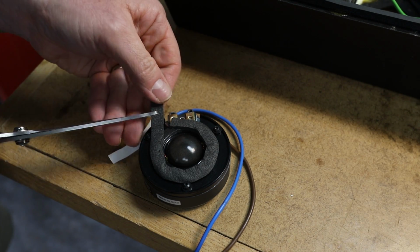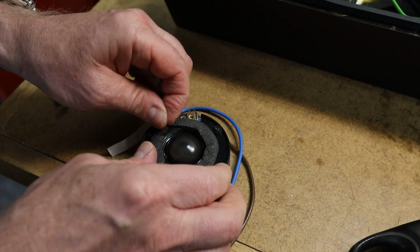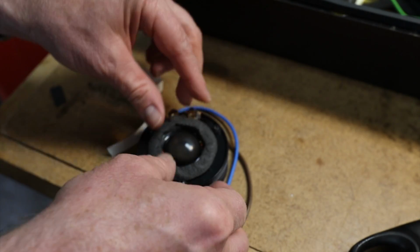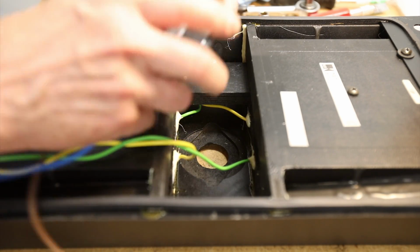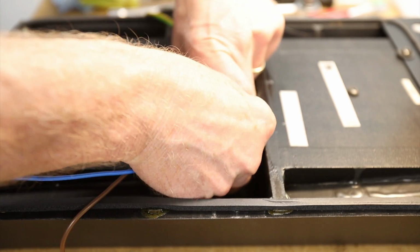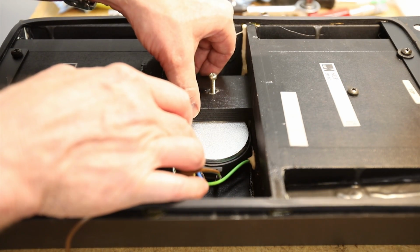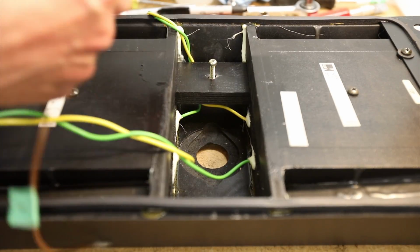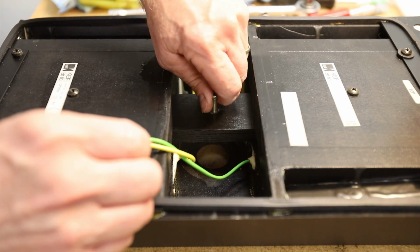Since the screw heads protrude, it is helpful to add a piece of 5 mm weather stripping around the existing seal to make sure the tweeter seats up properly against the enclosure. The Morel tweeter is about 3 mm thicker than the TS 1191 tweeter, so the wood block does not slide over the new tweeter. My husband has come up with a very simple solution to solve this problem. A small modification to the wood block will allow the blind nut underneath to be recessed and the tweeter to fit properly into the enclosure.